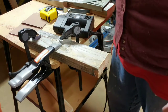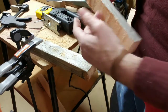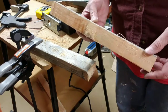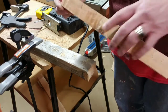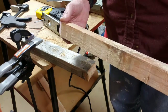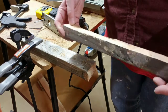It's called a rip when you cut the wood long ways. And now I had to pull the last little bit apart because I didn't get perfectly in line right here. That's the thing about when you go from one end to the other — where they meet may not be exactly perfect. But that's okay on this one because this is going to be our handle. So we're going to end up doing all kinds of stuff to this anyway. What's really important though is that one end or the other is really square. And in this case, both ends are really square.